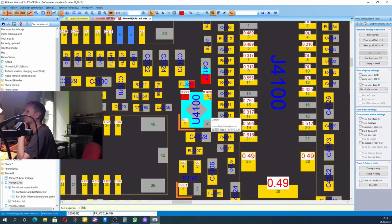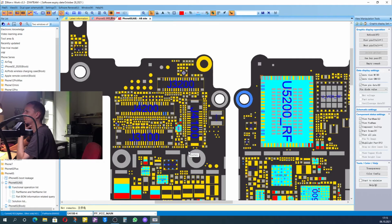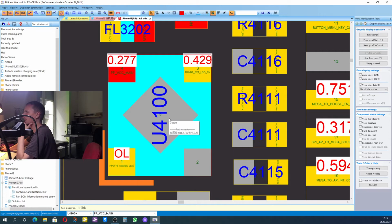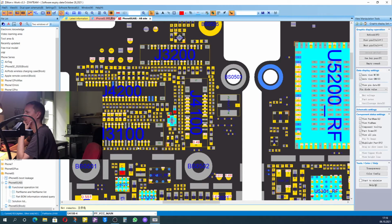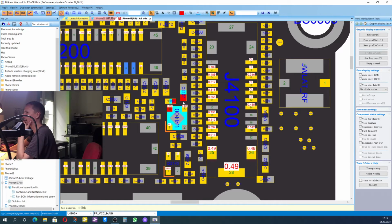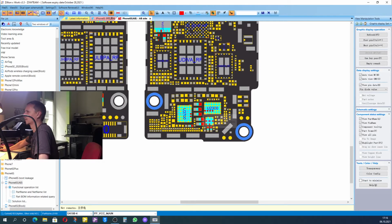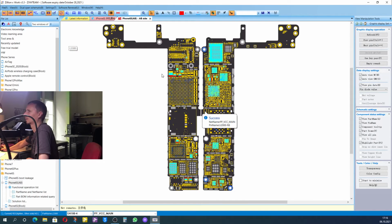On this filter, I don't know what it does. 4100 could be same part as we have on the cameras. I think it's something for pull up or pull down. By XLDO enable PP 2.57 blah blah. This will pass here and maybe go to Mamba LDO. Over here. Well, here we have diode and cap. Well, can follow this track wherever this goes. Also going to Wi-Fi. Okay, I'm not gonna pull this through.